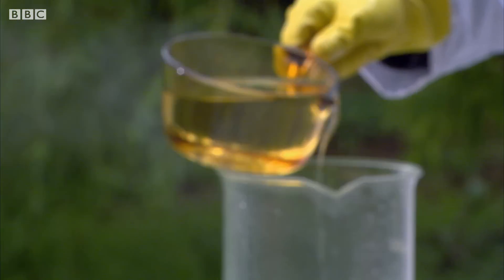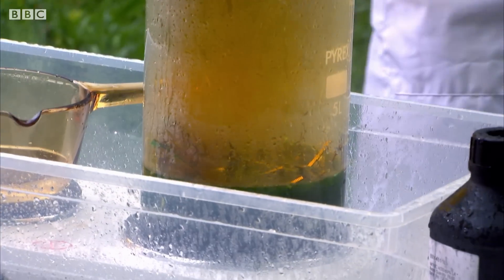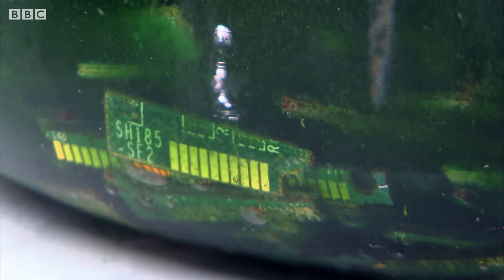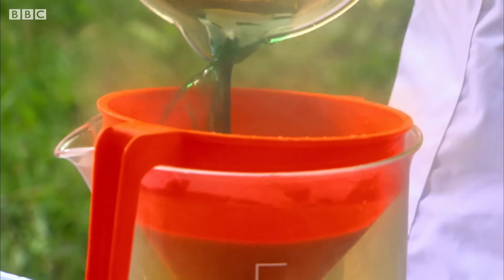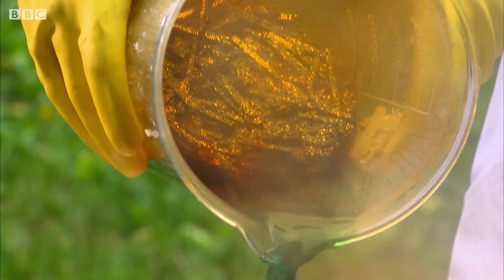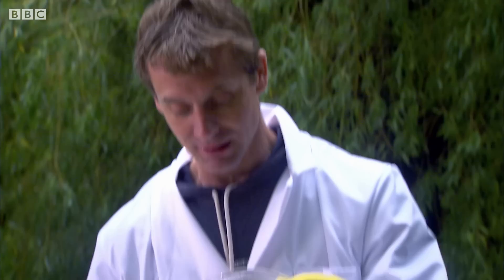This is concentrated nitric acid — really nasty stuff, especially when it's heated up. It'll dissolve practically all the metals from the circuit boards, but it won't affect the gold. In industry, they'd extract the silver and copper from this, but I've only got eyes for one thing: gold. But it still leaves us with the problem of separating the gold from all the undissolvable rubbish in circuit boards, which means we're now going to have to dissolve the gold.